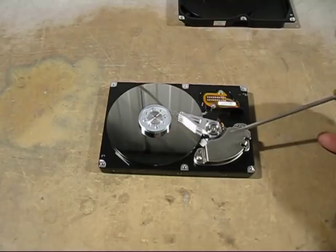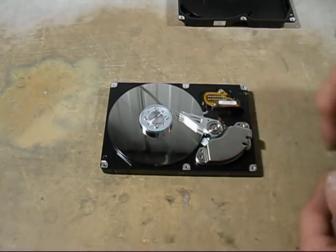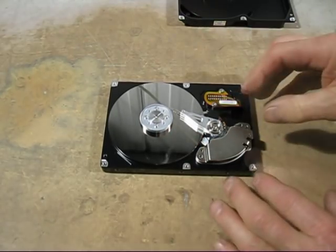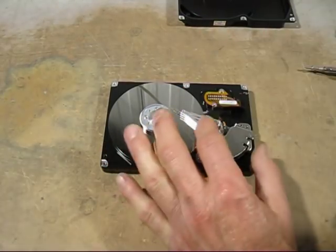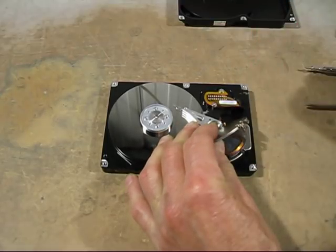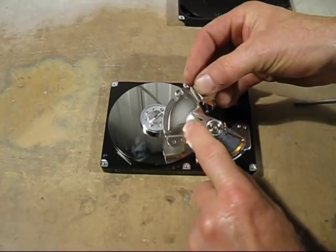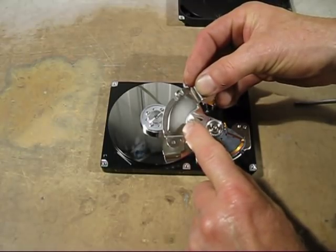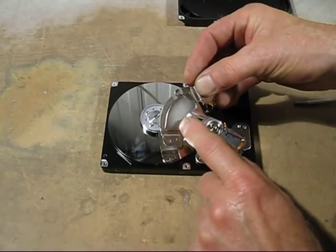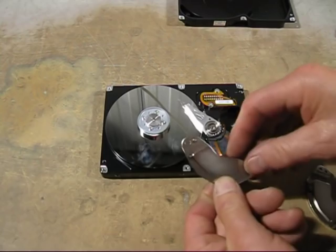This is what we're after — that piece there. The one underneath is MU metal. We can lift the first one off — it is tight because of the super magnet on them. There's the first half and the second half. We can't use the super magnet — they call them rare earth magnets — because this stuff you don't want to add to cast iron, it makes it really hard and brittle. The bottom half comes out quite easy, and there's the bottom half.